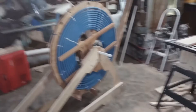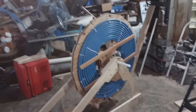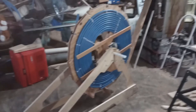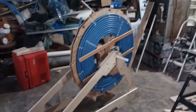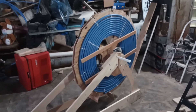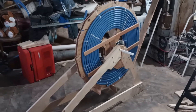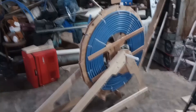This is a high lift spiral pump that generates both air pressure and water pressure — air supply and water supply. This one should pump up to over 60 feet. It's a three-coil pump that delivers very high efficiency; it should do about two gallons a minute, depending on the speed of turning. Even at a slow speed — from what I've seen of the creek water — if you put a leaf in the water and it moves one foot per second, you figure the area across the water and the depth, and you get an idea of how many gallons per minute is being moved. That's the speed we can look at this turning at, so things can be calculated.